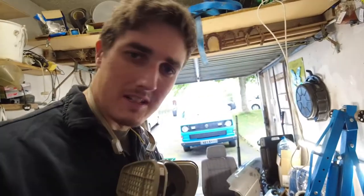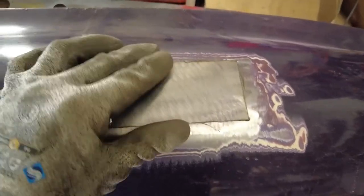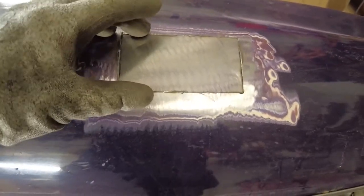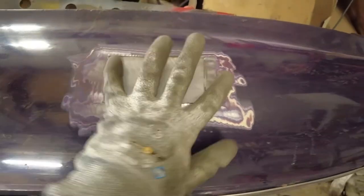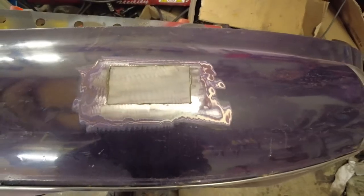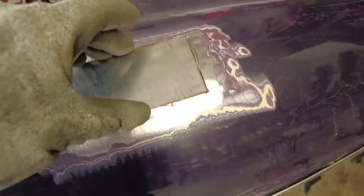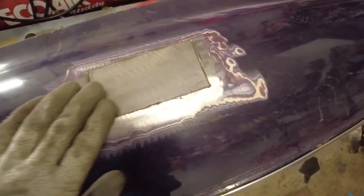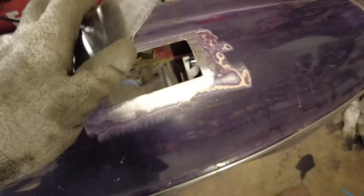What we're going to do is offer that up into the hole and see how we get on. I'm aware it does need to be deburred, but it's not far off the mark. By the time I've put a little bit of a bend in that, you may as well get the bend right before you try and take any extra material off it, because otherwise you'll find yourself a little bit short. So let's dress that up a little bit and then see if we can bend it.